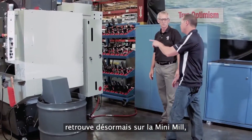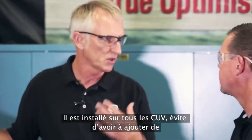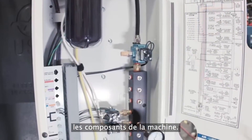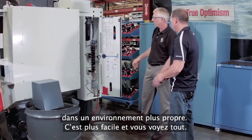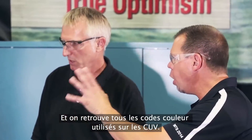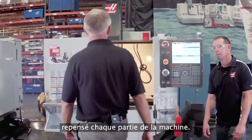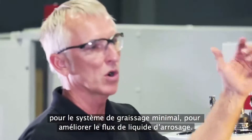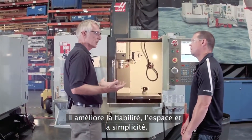Something I'm used to seeing on the verticals, and now I see on the Mini-Mill, is this lubrication cabinet. The min-loop system is really the heart of our reliability efforts — this is on all the VMCs. You don't have to add oil every three or four weeks now; the grease lasts for a year. We got the solenoids out of the head and brought them down here in a cleaner environment. It's easy to get to, you see everything. We have our new air pressure sensor on there and all the color coding. Everything kind of looks the same, but really we've touched every part on the machine. The head cover is re-plumbed and re-wired for the min-loop system to get more coolant flow to the tip. You can see the cable carrier we have on top now — it's different from that old tube, it makes it more reliable and leaves more room, easier for us to run things.